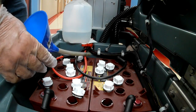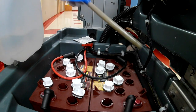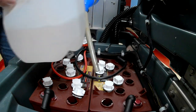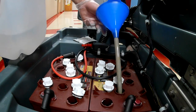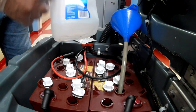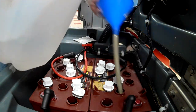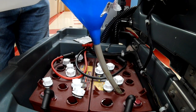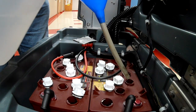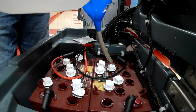Keep in mind you don't want to put too much water in your batteries. I like to use a funnel — it's great for a lot of things. I'm just going to pour just a little bit of distilled water, and that's about all that cell needed right there — just enough to cover the cells up.